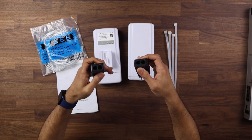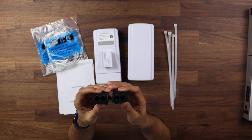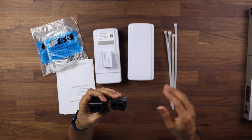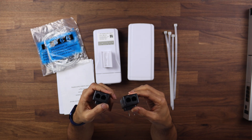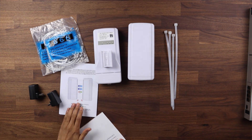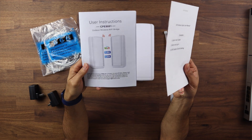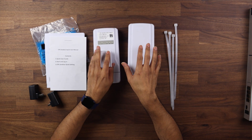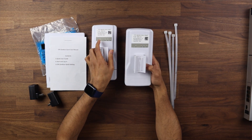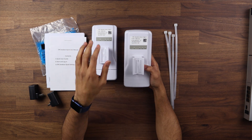These adapters have PoE on one side and LAN on the other. They are 24 volt, so not all switches will pass through 24 volts in terms of power. The switch I have in the office does, but the UDM Pro won't provide 24 volts so I need to use one of these adapters. You get instruction manuals including a quick start guide. In terms of getting this set up there is a master and a slave, and I've already gone ahead and changed the IPs to match my network.